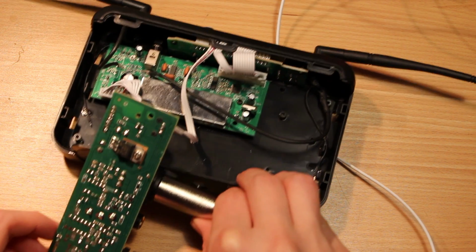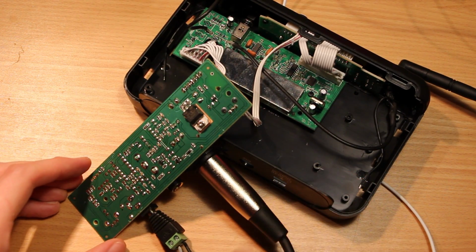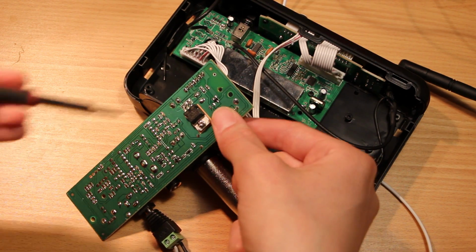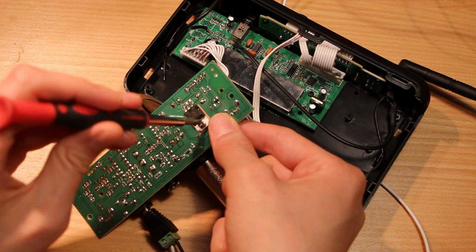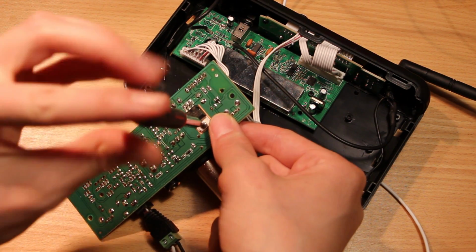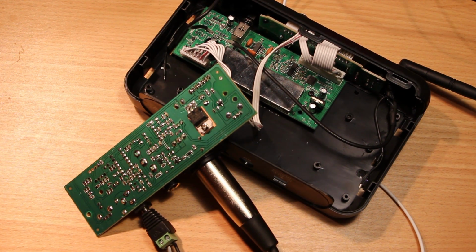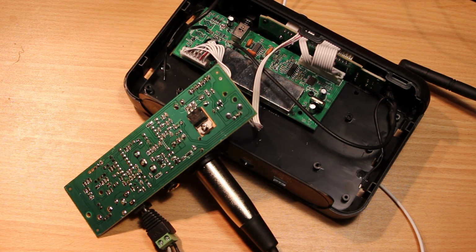Alright, we're back. And this board is far more than meets the eye. That bolt was just the beginning. I'm going to tighten this back because it is loose and it's holding on a 7809 regulator. Oh man, and that board that looked like it was so cheap and gross really has a couple of components on the back. It's got a couple of resistors and capacitors. Transistor, maybe. That's much more than I was expecting. I mean, it's even got a solder mask.